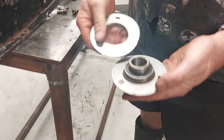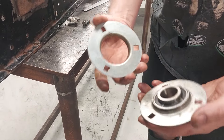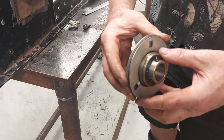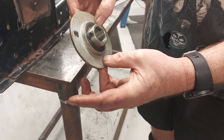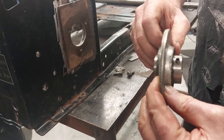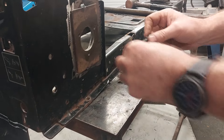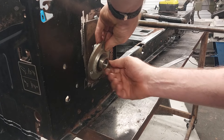The bearings I'm using are self-aligning bearings — they're 25mm with a couple of Allen keys to hold them on. The way they work is the two little pieces here squeeze together on the right side, and you don't tighten them up until it's fully aligned. That means you're not going to have anything binding on them. I've just tapped the threads in and for the moment just put these in loosely.